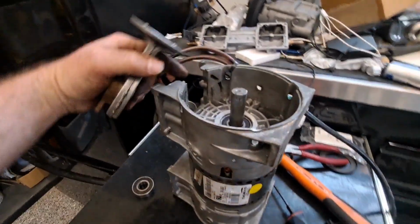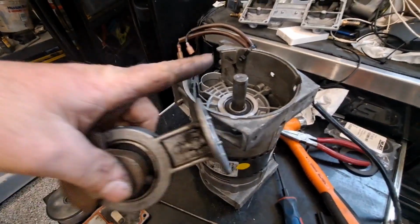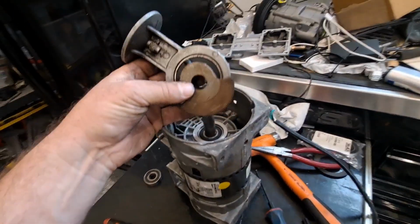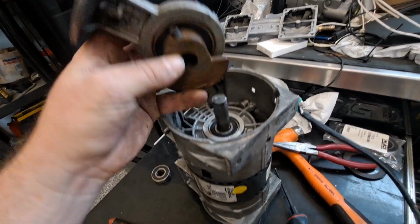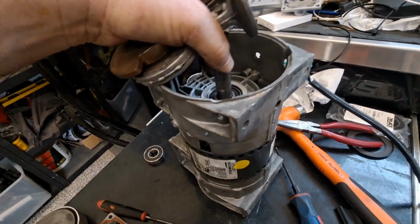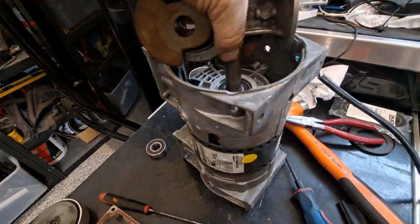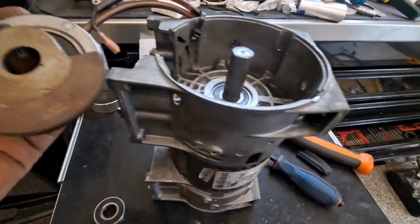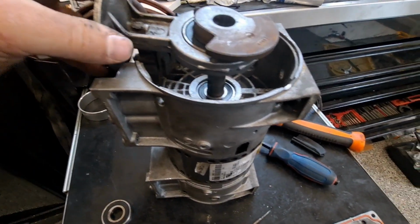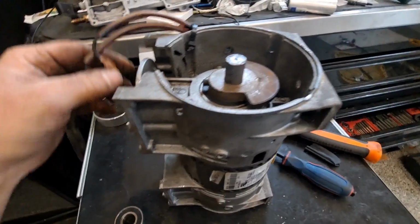You know, on second thought, I realized I was on my own getting this thing apart, and there were no videos getting down to this level, so I should probably show you a little bit more. All right, I'm going to put this connecting rod assembly back. That little set screw, that's an Allen, was on the flat part of this shaft, so I'm going to be ready for that. Now what I found is I'm going to put the flat side of the shaft up, so that way I can slide this little rod down in here. Okay, and I'm just kind of lining it up, and there it goes.